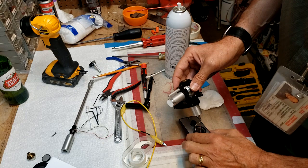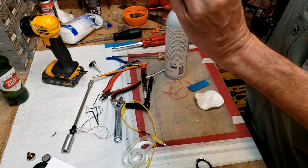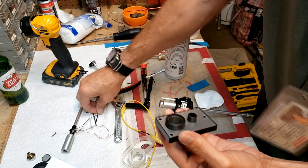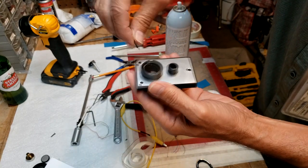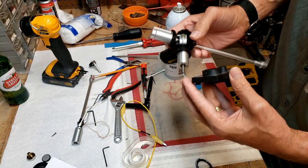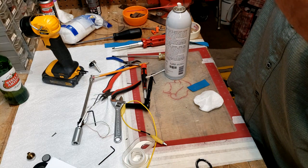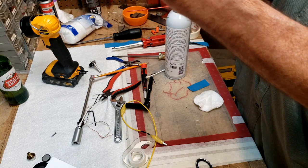these feed through down through the hole. And as I mentioned, these here. Oh, I see. Got to back these hex screws off because I didn't want them to fall out. Make room for them to slide in there properly. And of course this part is for the arm lifter. That's the VTA, so that we'll adjust to get the arm height properly.